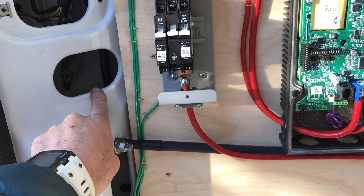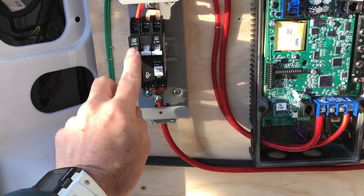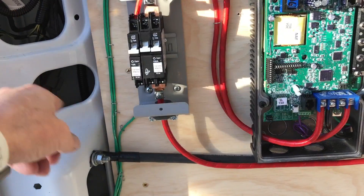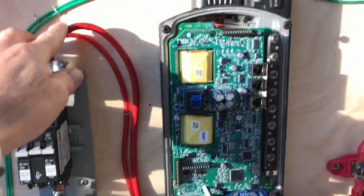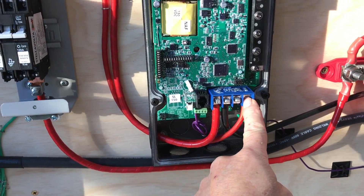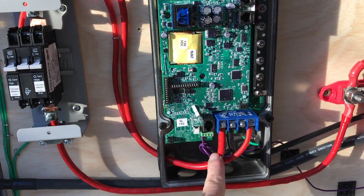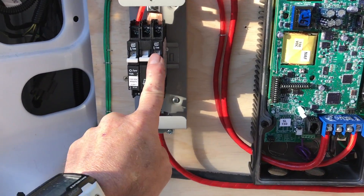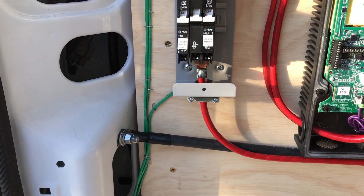It's got about 9 amps coming in and this is a 15 amp breaker, so it's going to come in here and hook up here. I can control that power with this breaker. So often there'll be no power beyond the roof — it comes up, goes out, and then goes to the positive photovoltaic input of the charge controller. The charge controller does its thing and passes it out back towards the batteries, but on the way to the battery it stops through this 100 amp breaker.